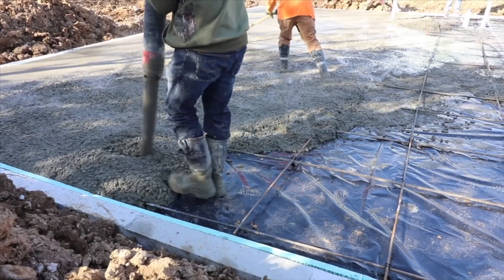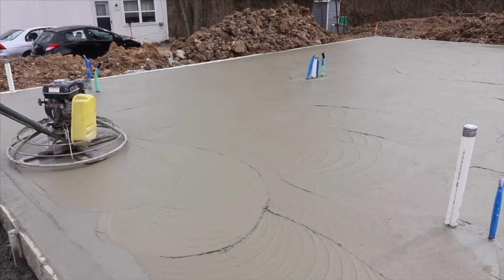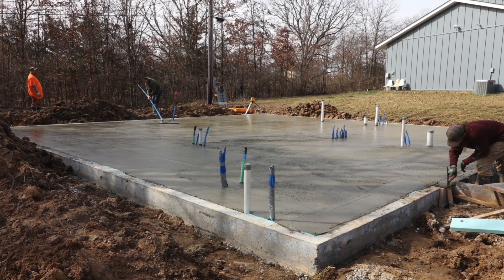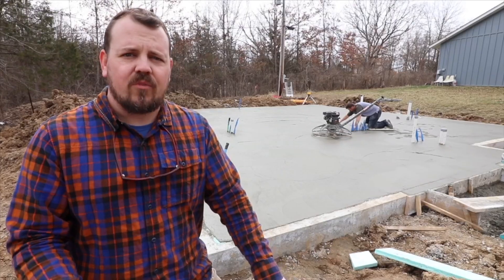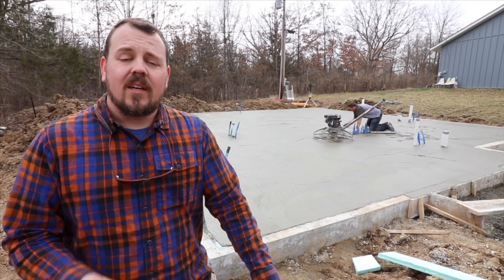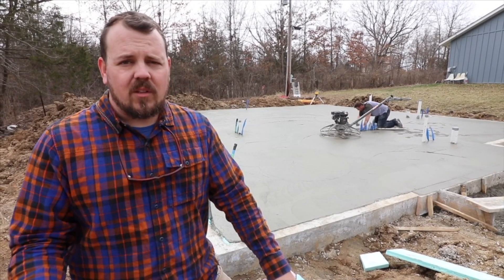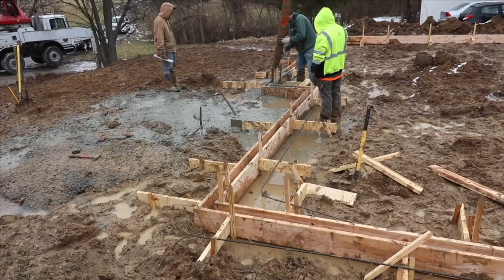The difficulty with that is when you have that concrete slab come over, turn down, and tie to the ground, that concrete will be exposed due to code — there's six inches of exposed concrete before you get to soil. That means our slab that you're going to walk on is thermally coupled to the outside. Looking at one of the neighboring houses here, I can see concrete that's less than eight inches from where you're going to put your foot, and four weeks ago we experienced negative nine degree temperatures here in Missouri. There is absolutely no way that concrete floor is comfortable at negative nine degrees. One of the goals of building houses is control of our environment — that separation between outside and inside, which is why we put insulation in the walls. But for some reason, our market and most markets in the United States build an uninsulated turn-down slab assembly.